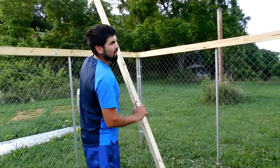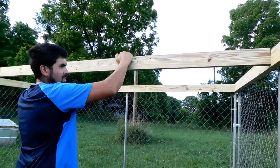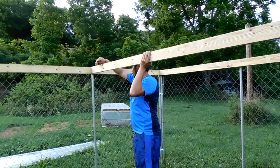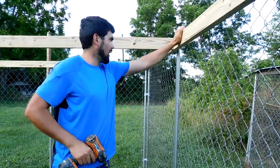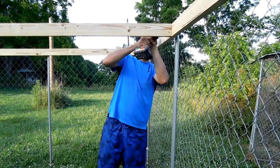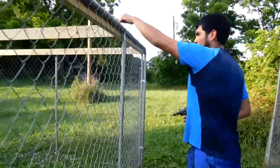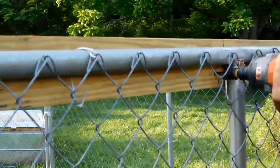I showed you the X marks. Put one side in first, then the other side, and I kind of do it a little tighter than it's supposed to be. As you can see on these right here, when you drill this board to this pipe you're never going to get it square. Screw a couple on the side, on the inside, and go through the back as well. I made this pencil mark on the back side and it will tell me right where I need to aim to put the screws. There's one, there's two, and she's locked in.